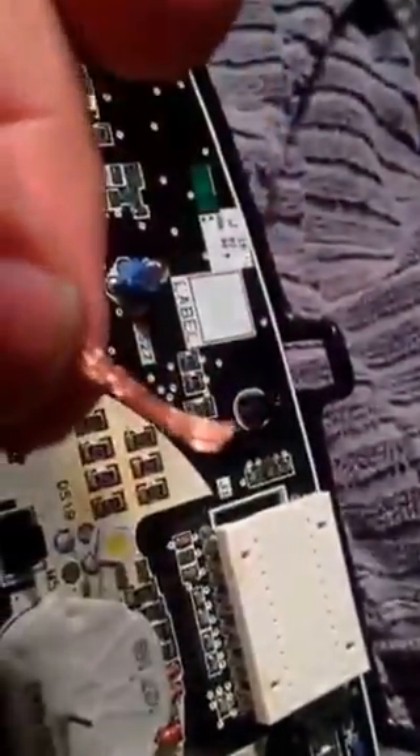As far as the replacement kit goes — honestly I wouldn't waste my money. Get desoldering wire instead. There's a trick to it: you want to get a pair of scissors and cut off the little ends. You're going to heat up the solder until it's melting and able to flow, then just come in and touch the braid in and it'll soak into the end. Keep clipping off about a quarter inch at a time. This little roll will last forever. You want it soaking into the end of the braid, not the sides — that's the trick.